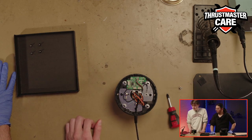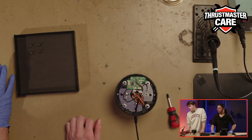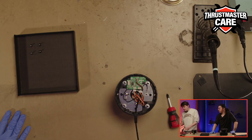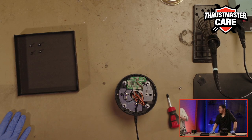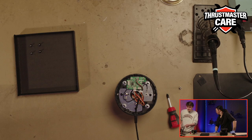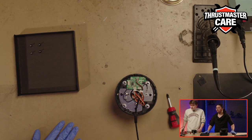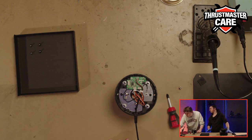soldering iron warm up. So we recommend a temperature of 350 degrees. I think it's good. I will just plug it to be sure that it will work. Celsius or Fahrenheit? Celsius. I think the equivalent for Fahrenheit is something like 660 Fahrenheit, I think.